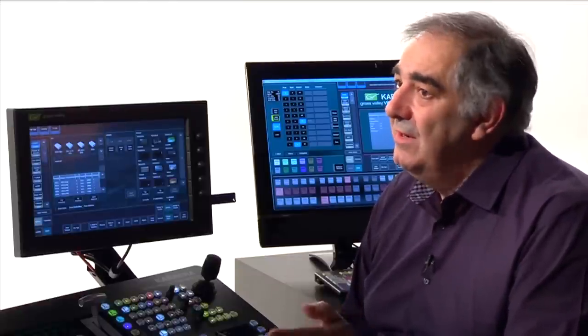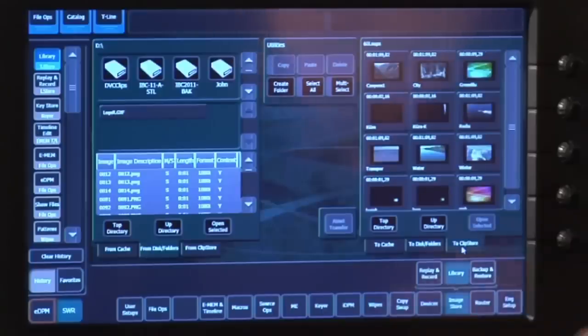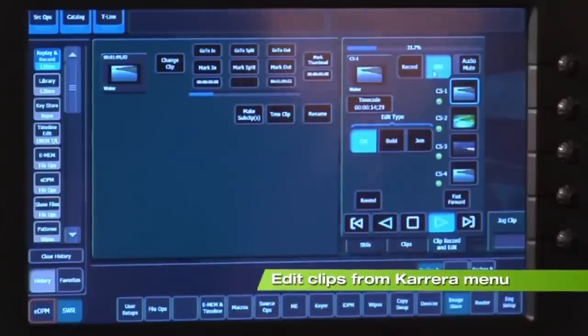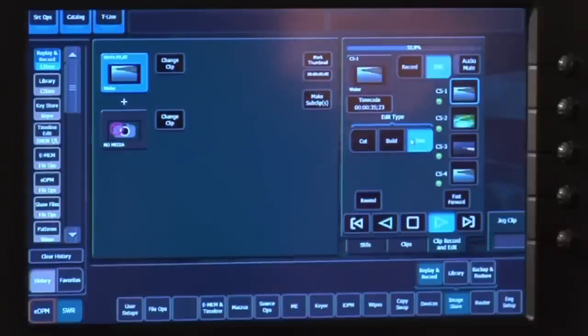I do want to make sure I have the correct format — we're not going to do a complete format conversion within the menu for movies, as these can be quite long. Inside replay and record is a tab called clip record and edit. I can record movies directly to my server — though thumb drive based clip transfer by file from the graphics department is usually easier. Once I've done this, I can go into edit, top and tail over records, build a multi-layer clip from video, key and audio clips to make one complete new clip for use on air, slide each of the audio and the matte against the video, and join clips together to make two clips into one.